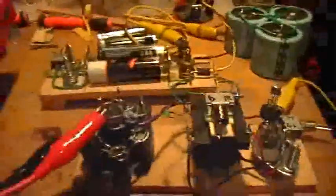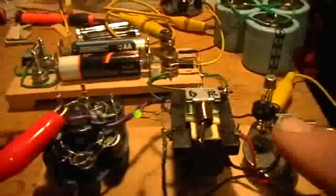We've got some residual charge on the capacitor and nothing happens when we touch anything. Let's pump the capacitor up to the two-battery voltage — 2.15 volts. The light didn't come on; it's not doing a Joule Thief thing. I'll turn the battery off and unplug it completely. We still have voltage on the capacitor. Now — there's the ghost light. I'm touching: ghost light on. Not touching: ghost light off. I'm going to turn off the overhead light.